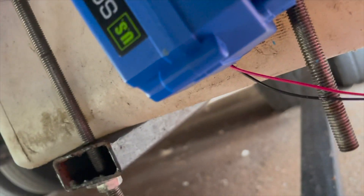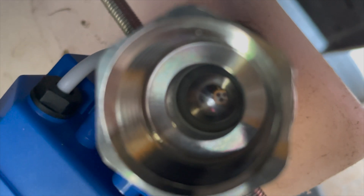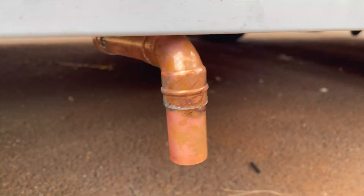The valve's in and the power has been applied to it. It should be open — let's have a look. Here's the valve open. I can see in there. Now if I disconnect the power... it's closed. Happy days. I just need to crimp this up, waterproof those joints, and then add the tap on. Then we can set it up with the switch inside. This was tightened up with a spanner and some mole grips, and then I thought it looked a little bit wobbly, so I added one of these brackets and then it was solid as a rock.